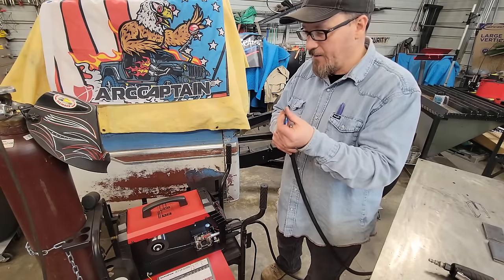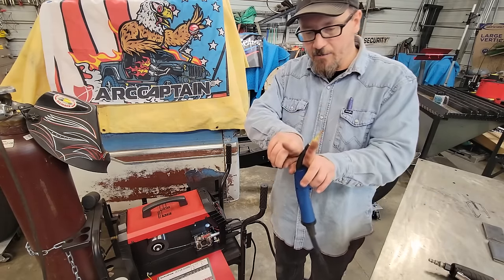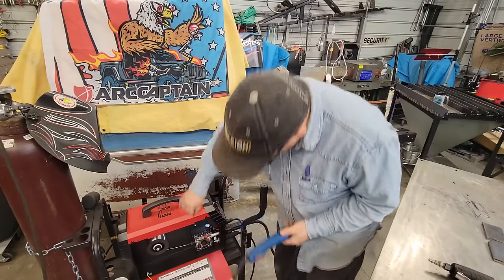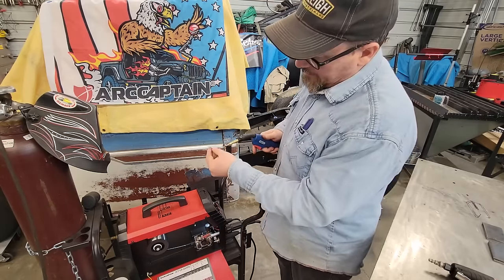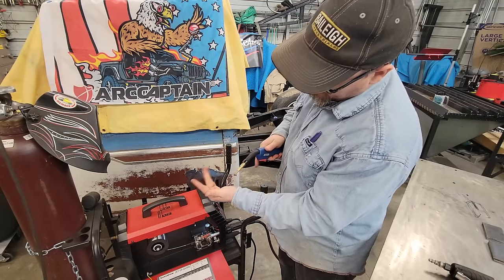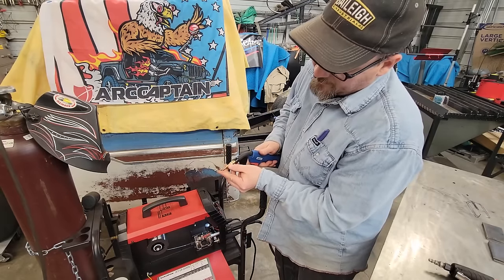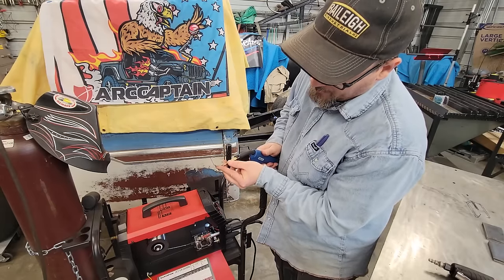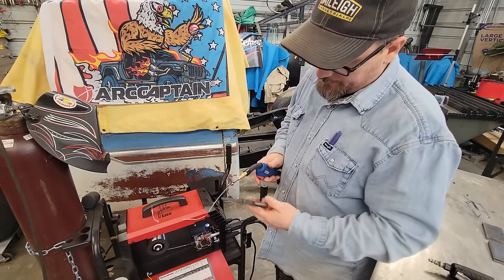Like I said, you don't have to crank it on these. When you're using solid core, they have rollers in this machine that the groove's like a V, and you can tighten it down pretty good. But this right here is the rule of thumb. I'm going to back it off, and I'm going to take this thing and bend it. See, it's not slipping. I'll back it off just a little bit. See, it's slipping a little bit on that. Just about right. You want it to where it barely slips through there like that. That's about right.